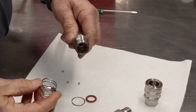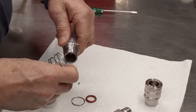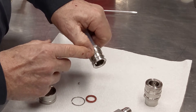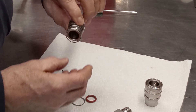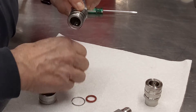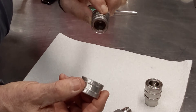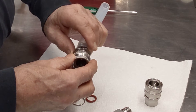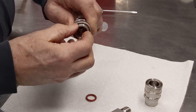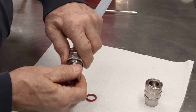The tricky part is getting these balls back into their appropriate spots. What I do is put one ball in at 12 o'clock, take this wire and get it in front of that ball, then rotate it so that's at six o'clock — that leaves you two extra spots at approximately 2 and 11 o'clock. The spring down here is holding that ball in at six. Take your collar, slide it on like this, put your o-ring and clip back on, and that's it — back in business.